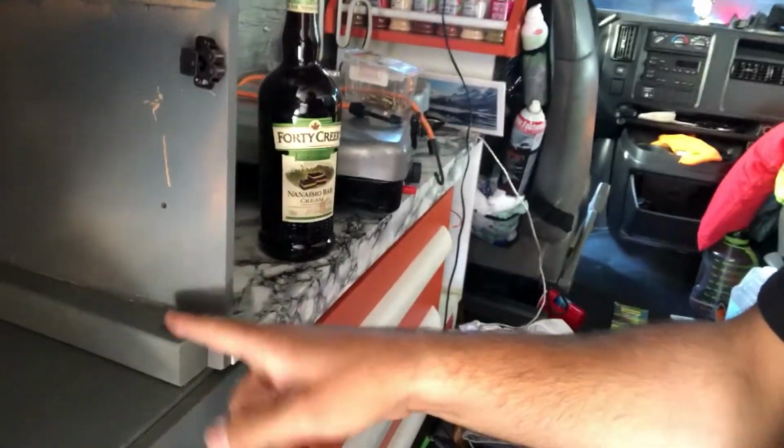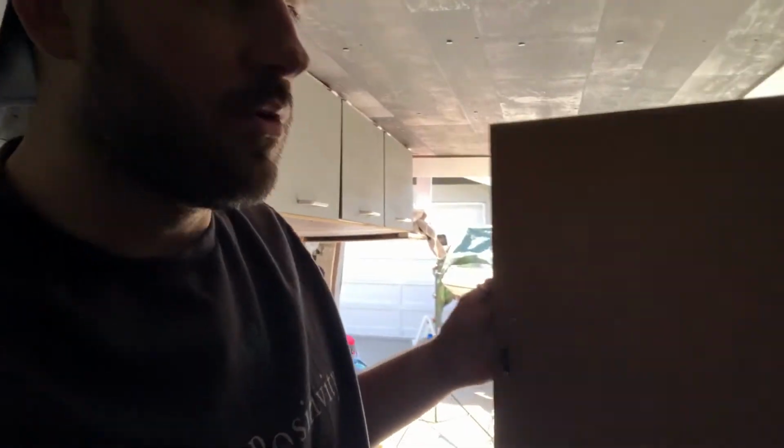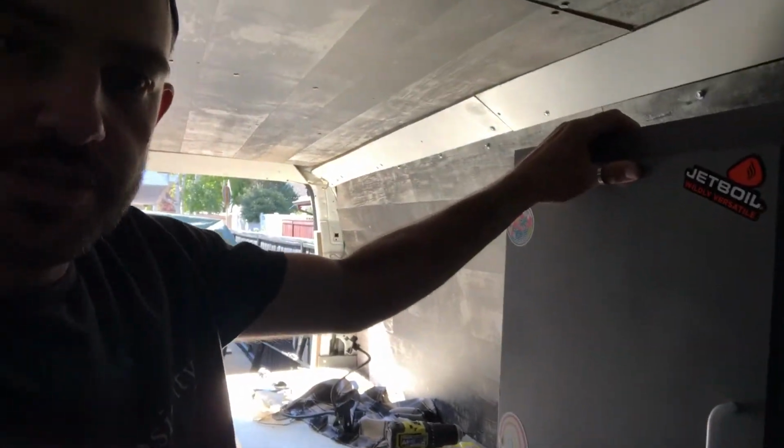I'll show you here. There's just a little bit of that leftover scrap. Well, it was 2x2, roughly, not really. But I spray painted that side gray and this side gray. And what you can see, this was leftover of the Cullwood. It has a big dent out of it, but there's construction adhesive along the bottom and the back side where it connects to the cupboard, and then screws in here to keep it secured to the lower cabinet. And then screws on the outside to keep the new cabinet attached to that brace down there. It worked out really well, and it's really sturdy.